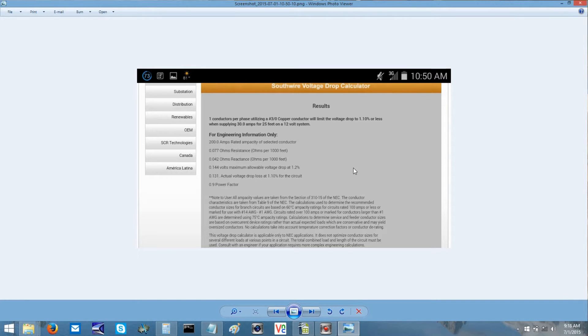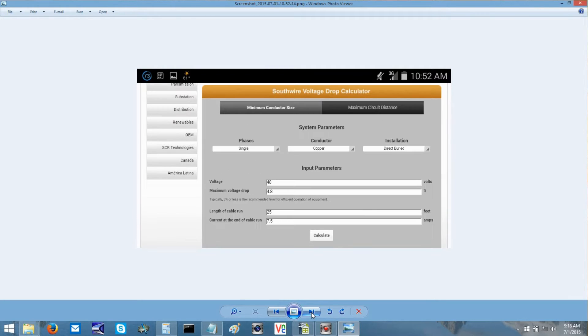In the case of a heating element it's not a big deal, but if you're running a motor at the other end of this circuit, it's going to cause that motor to work harder and it'll run slower. So that's something you've got to take into effect. At 12 volts for a 360 watt device, we're using a 3-aught copper wire.